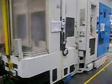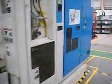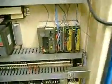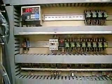This here is an A55 Epsilon machining center using a FANUC 16 controller whose logic sequence was created using Z executor and compiled into an EEPROM. So there is no way we can change the logic sequencers. So I grabbed some signals from the I/O modules and used a Makino PLC to enhance the machine, because we were concerned about the machine safety and we wanted the machine to work